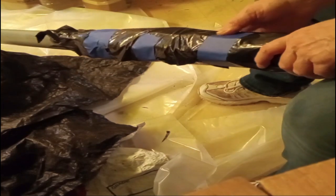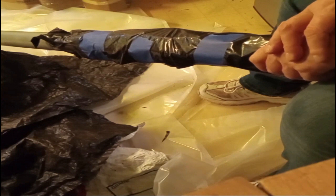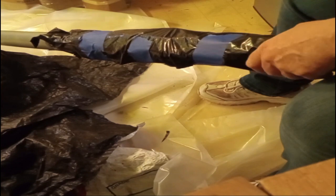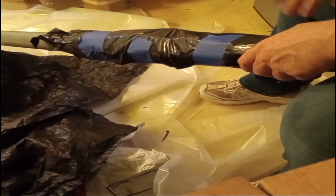We've got cardboard on and then plastic to kind of protect it. Now if you have foam, pillow stuffing - shirts aren't necessarily going to work. You could use wall insulation, the pink stuff, as long as it's contained in bags so it doesn't get all over. And if vermin get in, such as mice, rats, chipmunks, squirrels - they won't be taking the stuff out a hole and leaving you with nothing. So you really want to secure your pipes.